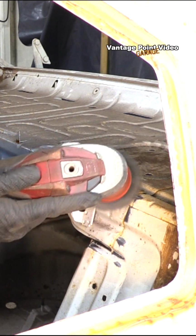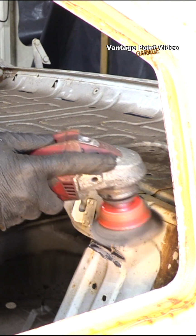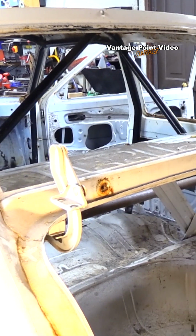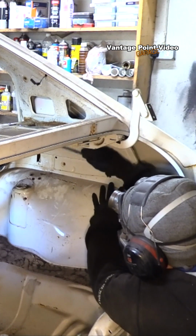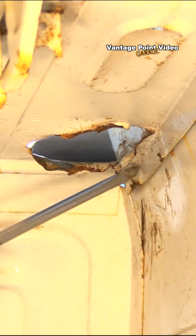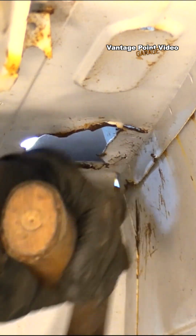Now, moving on to the rear boot area. This is why I chose this type of Kadett D shell. There were a hatchback and a saloon version, which both had the same silhouette, and I think that this has the potential to be a much stronger shell and therefore give better handling without too much of a weight sacrifice. The rear tailgates were very heavy, so someone has chopped through the metal parcel shelf on this car.